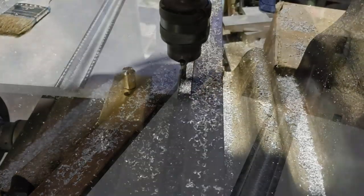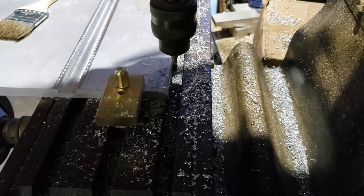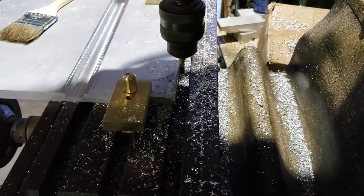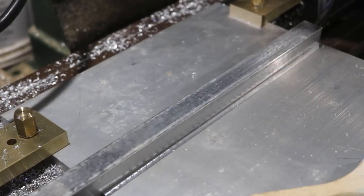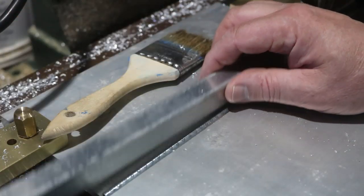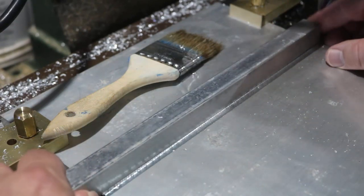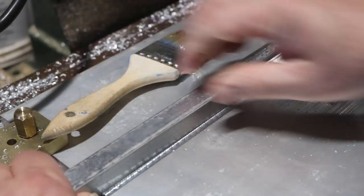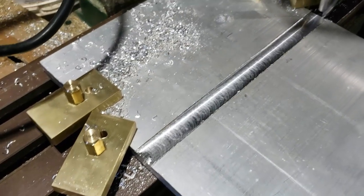The first one's done. Here's the back end of it — I'm just going to do a skimming pass initially. You can barely see anything flying off; I really don't want to shorten it anyway because I already have it one-eighth of an inch away from the blade. This is where I found out I was off by about two thousandths, so it was important to do that. I've put the runner — this is what's going to fit in the groove on my table saw — right now it is a friction fit and I could drift that in with a mallet. But since I wasn't really sure how I wanted to attach this, and this is just my first run, it's easier to take a little bit more off than it is to try and add it back on.